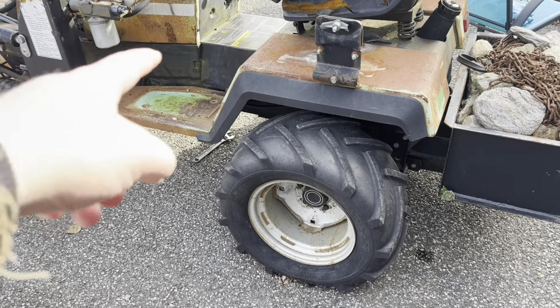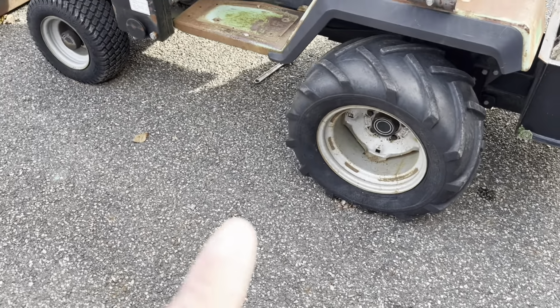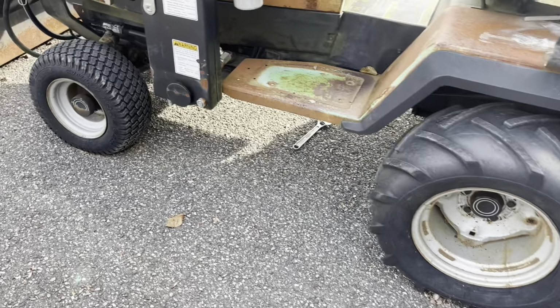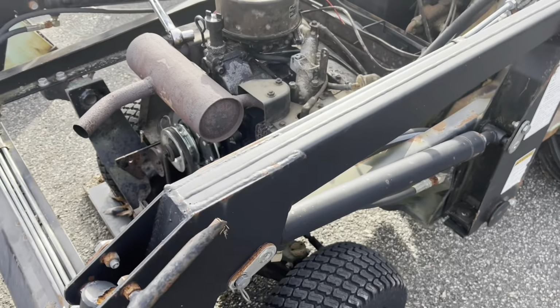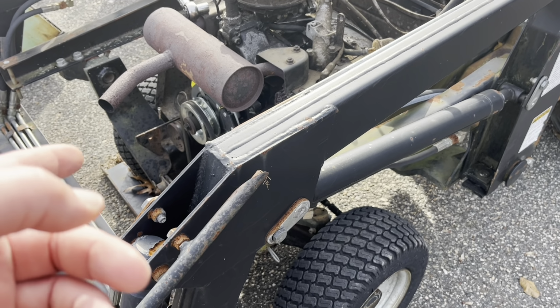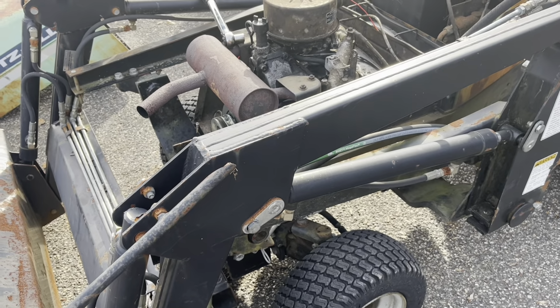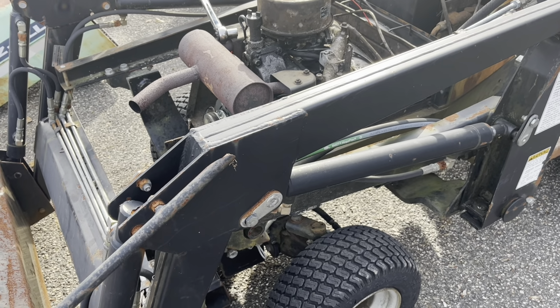All right, well, I figured out how to hold it. Underneath the tractor, there's a U-joint about where that adjustable wrench is. I can put that wrench up into the U-joint and then the flywheel doesn't turn. Well, I need a helper. I can't do it by myself. I can't reach the two of them. So I'll have to wait for someone to come home and then maybe they can do the torque wrench and I'll hold that underneath. But it's challenging. So this is on hold until we can get that bolt tightened up.